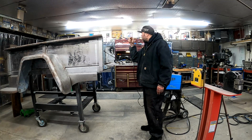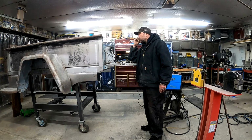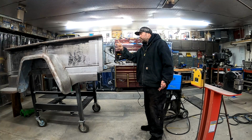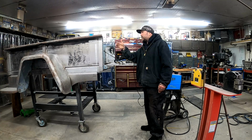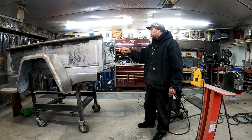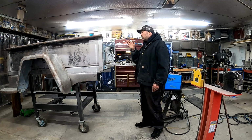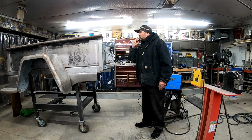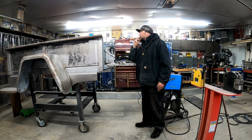It's just clearing the bolt now, so I gotta pull that side back apart, and we gotta take an 1/8 inch off of that side so that they match. I re-measured everything again. Dude, we are spot on in the exact same spot as that side. And the cables are tight on both sides. I mean, it's perfect. Why this side ran into it, I have no idea. Somebody made this bed, there's nothing straight about it.